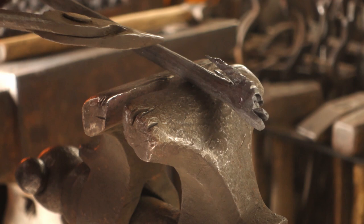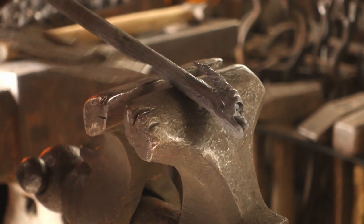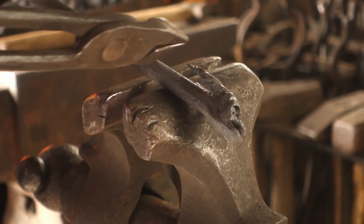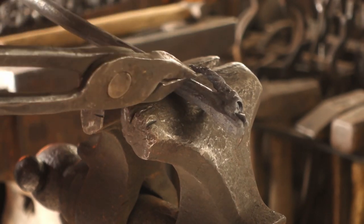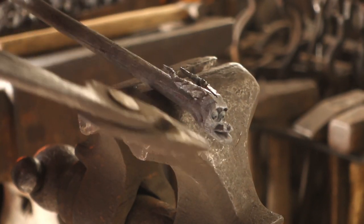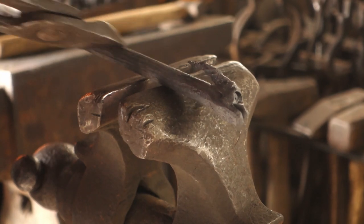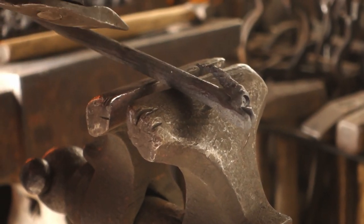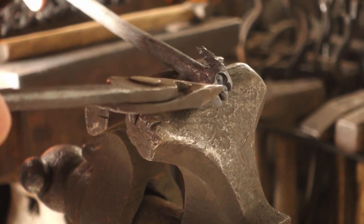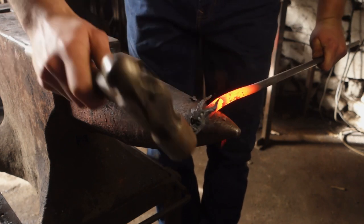You can sort of see — I don't know if you can see it on camera really — but where the texture is nice and it flows into the back. Whereas if we were trying to texture this now, we would only be able to get up to where the horns are, rather than the texture actually flowing into the back of the head. It looks much better this way, the texture flowing all the way in. So we've got to put a bit of shape into this — it's not just going to be coming out at a rakish angle out of the rock. So I'm going to put a bit of a loose swan neck into the piece, and then maybe see if we can put a tongue into the mouth. I've quenched off the head and the horns so we don't bruise that, as we're now putting in this bend.